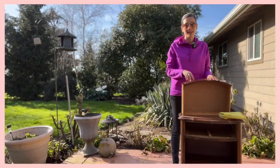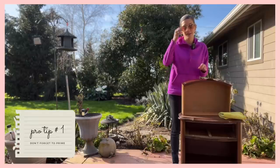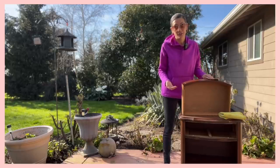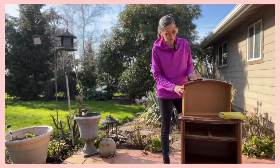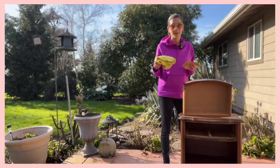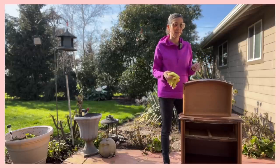It's important when you're going to be painting anything that has a glossy or smooth finish that you prime it and get it a really good surface to grip. I always think of when you go get a pedicure — they always buff over your fingernails and then do their base coat before they put the polish on. It's kind of the same concept. We went over it with the hand sander and also a sanding block with sandpaper so you can really get in there. We're not looking to take the entire finish down, just give it a little grip surface.